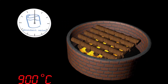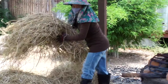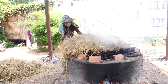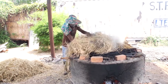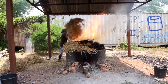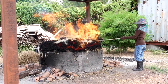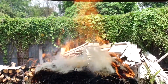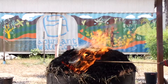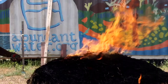Once the fire is burning, you'll want to get the temperature up to about 900 degrees Celsius. Do this step slowly, giving yourself several hours. Once it has reached 900 degrees, you can begin putting rice straw on top of the kiln. Please take note that the straw will catch fire. The burnt straw will create a vacuum that keeps the heat inside of the kiln and helps us to maintain a constant firing temperature of 900 degrees. This is to avoid temperature shock to the filters when heating and cooling, to avoid cracking.